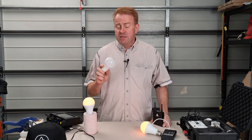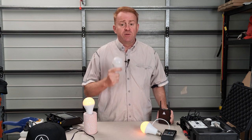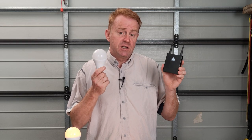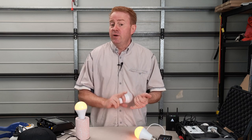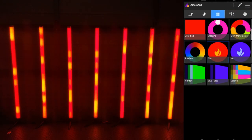As of a recent firmware update, you no longer need the Astera box to talk to your globe if you're using the phone app. Prior to that, you needed the Astera box to communicate to all your Astera product. Now you can use one of these globes instead — however, there is a catch: this only transmits about one-third the distance, around 100 meters versus 300 meters. I won't cover the phone app here as I did that in a previous Titan Tubes video — link below.